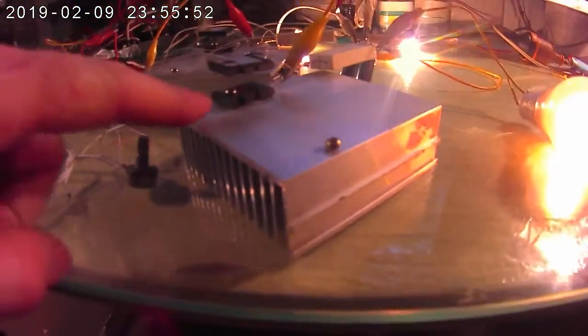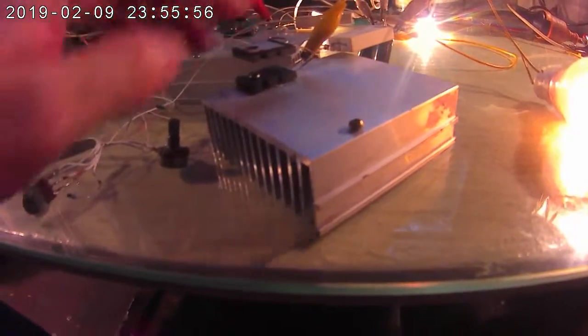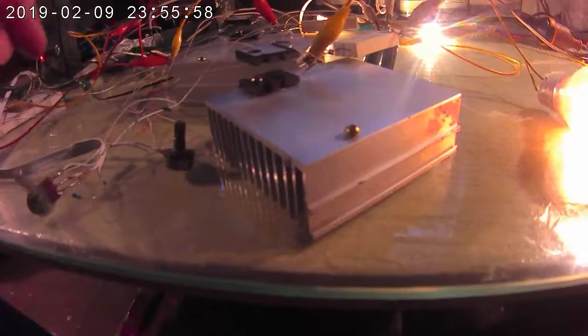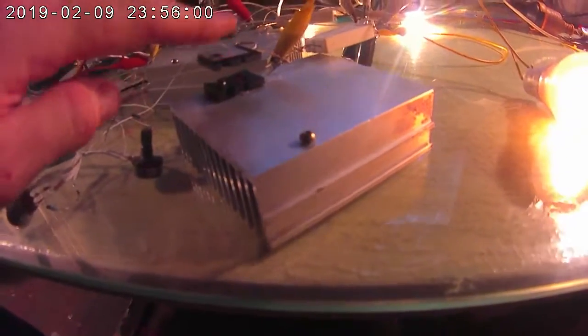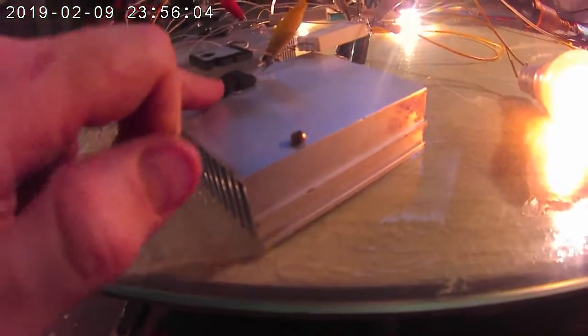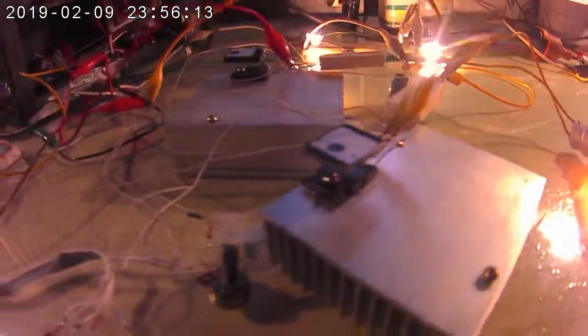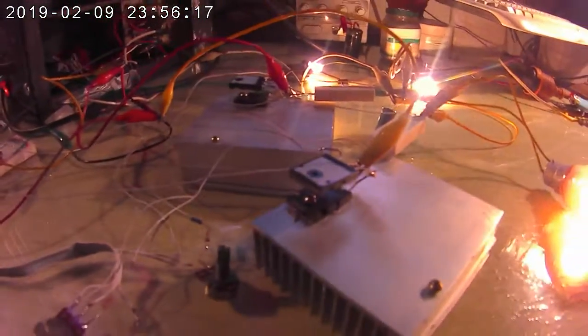The system is working very well. I've replaced the secondary transistors of the Darlington pair with the same type, so we've got one identical transistor boosting the current to the primary transistor. These are both C3998 — these are the transistors I'm using in basically all of my circuits, at least all the main driving ones.